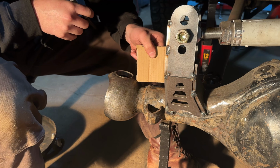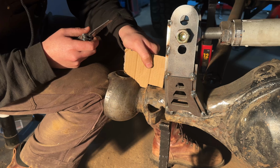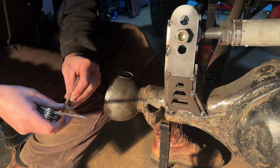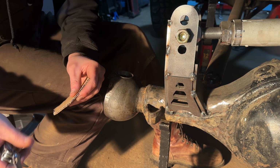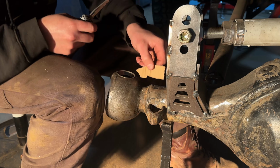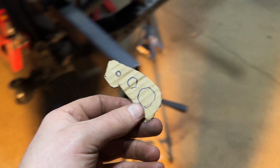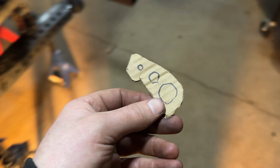We left off our last video by building this axle truss. Before I get started on figuring out how to put these air shocks under here, I need to tidy that up by finishing off some knuckle gussets. Knuckle gussets help reinforce the knuckles at the end of each axle housing, to prevent any bending from extra stress and strain from all these bigger components and driving on the harder trails the Samurai is going to see.